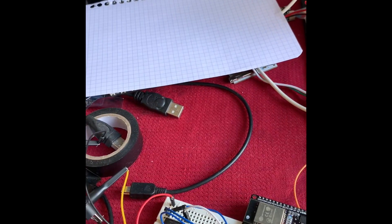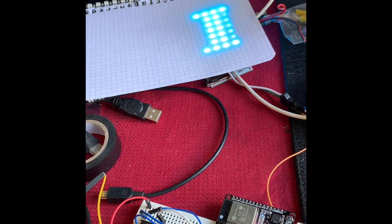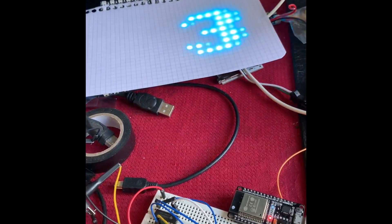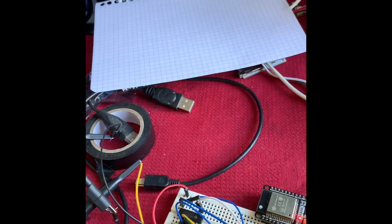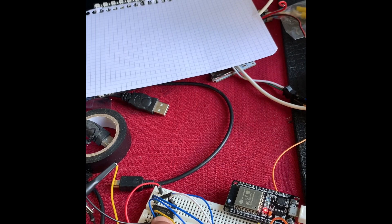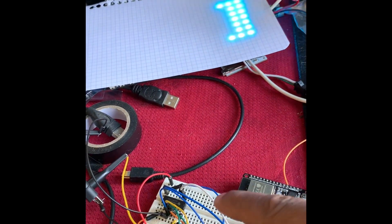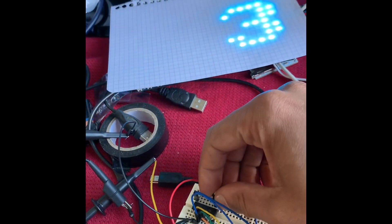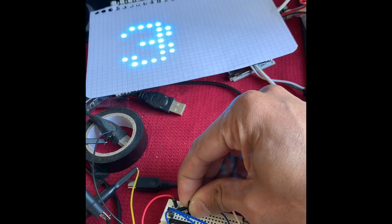Out of my ESP32 I've got the clock line, the latch line, and the rest just to plug the power and the ground. So what happens is out of this single data line, within the shift register, I can have five strips — a ratio of one to five. If I go around the output of my shift register, I move it one step more.